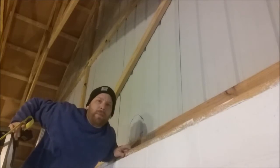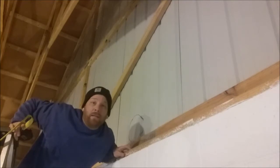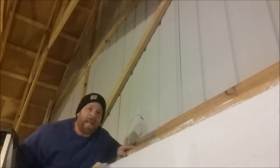The reason I'm doing these measurements: I have two elbows at 30-degree angles to get past the overhang, and I'm trying to make sure everything's going to work out on the outside before I cut that hole. So I'm going to go check a few things — if it's right, we'll cut the hole; if not, we'll have to do something else. After further investigation, I believe everything's right, so I'm going to drill it and snip it out.